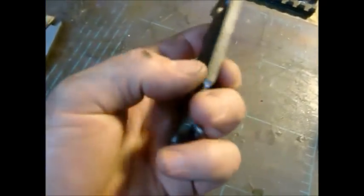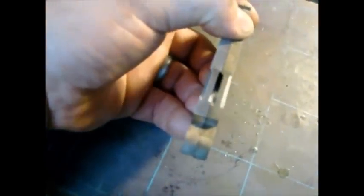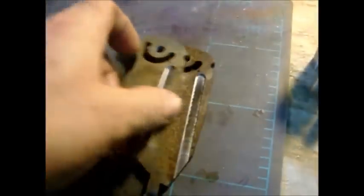It does look a little strange. This is just straight from water jet, and I built the jig straight from water jet, so it looks like these fullers are off. But once you straighten this point out — because from water jet, everything comes angled and a little oversized — once I straighten it out, it looks nice and even. I'm going to put them side by side so you can see them. Fairly big difference in how they look. It's not the best camera for this, but you get the idea. So once I grind them, they get nice and straight, but until then they look a little off.